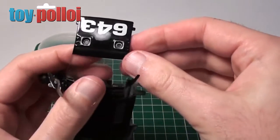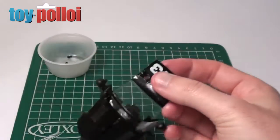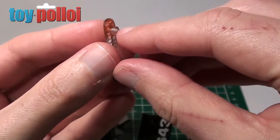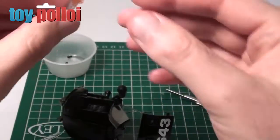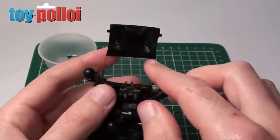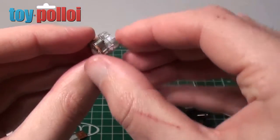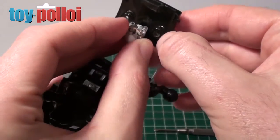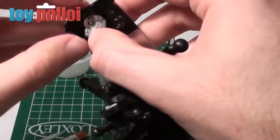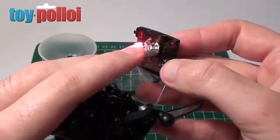Popping those lights off leaves quite a good top surface. I can drill the holes out slightly larger to fit the LEDs through and make minor modifications to the lighting section. If I carefully cut off these two larger prongs, I can mount the light cover directly on top of the two LEDs and it should light up nicely. I'll unsolder the LEDs, attach small wires to position them into the holes, then mount the battery section on top of the roof with a couple of wires running to each light.